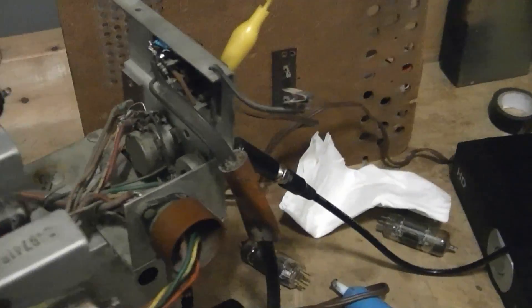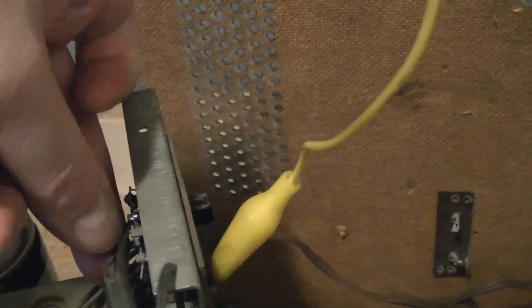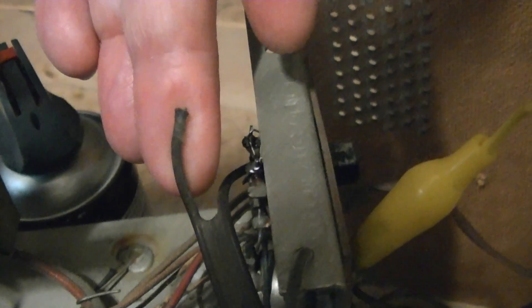I think I just discovered one little problem here. This side is the VHF antenna jacks where I've got my cabling going to my digital converter box, and the other side goes to some twin lead that goes into the tuner. And guess what - we've got a break. I remember this happened in another set some time ago and it also took me way too long to find that problem. I think it might have been my Motorola 12K too. So I will strip off a little bit of insulation there, figure out where that's supposed to get reattached, and solder it back on.